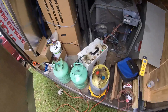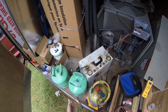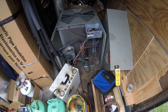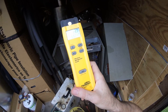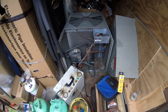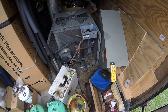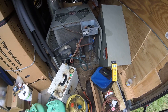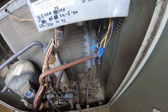Alright, doing a little experiment here — I want to see how much freon is left in an empty jug of R-22. I just got finished recovering this unit we pulled out, and interestingly enough I got 14 and a half pounds out of this sucker. I knew something was up with it — it wouldn't pump down, the compressor just bypassed. I knew she was packed full of freon and someone else was playing with it, trying to get their suction pressure up. I worked on it back then.